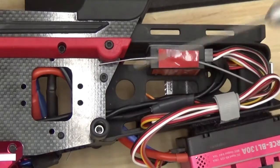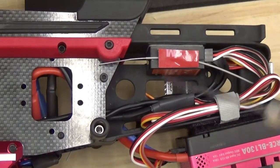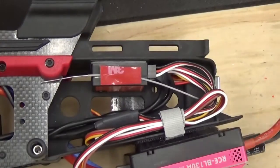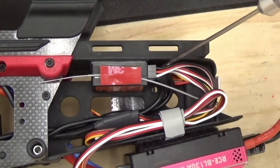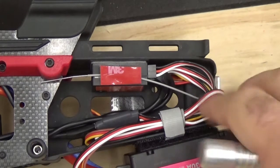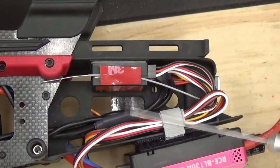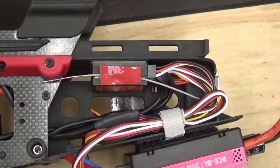I went ahead and used the two Align-provided servo extensions, which have heat shrink on them. This is actually the elevator and the rudder servo — they give me enough length to bring the wiring around the front of the microbeast. Channel 2 and channel 3 for the two forward cyclic servos had plenty of length as-is. Excess wiring is tucked up, with a thin piece of Velcro under the speed control holding all the wiring in place. The goal was to keep the fly barless accessible for programming and to avoid any excess cable tension causing vibration.